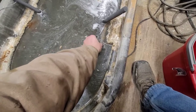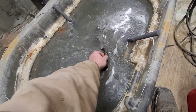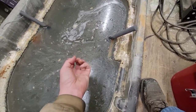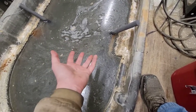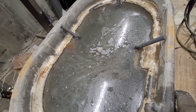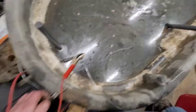I'm going to get this guy set back in here — I'll lean it on its side this time. You've got to be careful with castings like this. It's always better to have it completely submerged, but the problem is that when you lay something on its side, as these hydrogen bubbles get released they get trapped in pockets on these ridges, and the electrolysis won't take place unless it's actually touching the liquid. I've got it sitting on an angle now up against the side, so I'm hoping that will allow the hydrogen to flow out as it builds up.